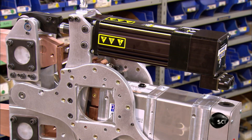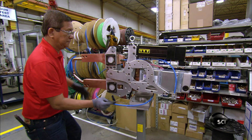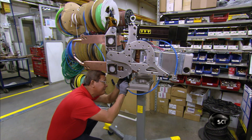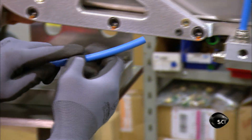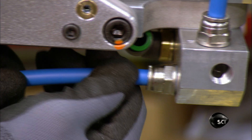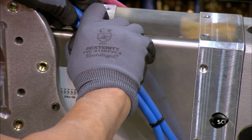But it won't be able to operate effectively without extensive plumbing. An employee cuts plastic tubing to length and connects it to the welding gun. This tubing will supply a constant flow of water to the gun. Without it, the gun would overheat and the electrode tips could melt onto the workpiece. He bundles some of the hoses and ties them together to neaten the installation.